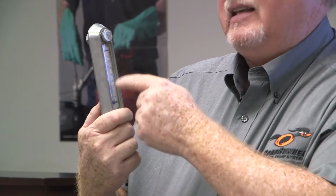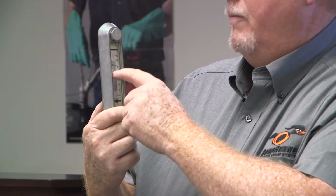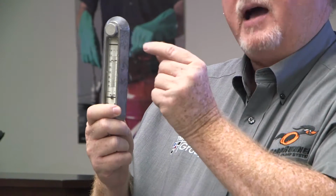But if I can faintly see, even if I can't read it, the lines or the numbers or whatever, if I can faintly see something, that's my gauge as, hey, filter might work. If I can't see it, too much water, start over again. Drain it and refill and go from there. But even if you drain it and refill, think about it. Your cylinders are still full of oil. Your hydraulic lines are still full of this watery oil. So you're still going to have water in your hydraulic system.